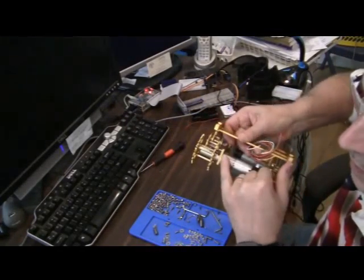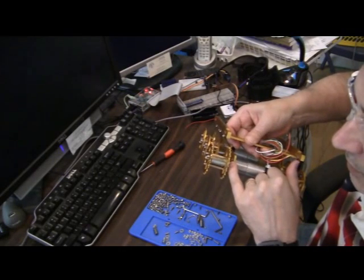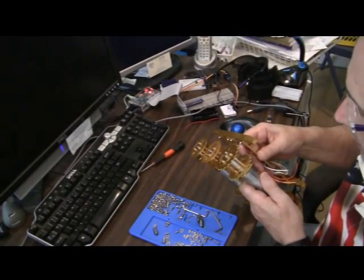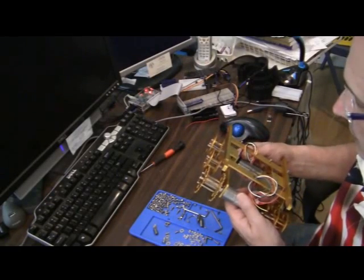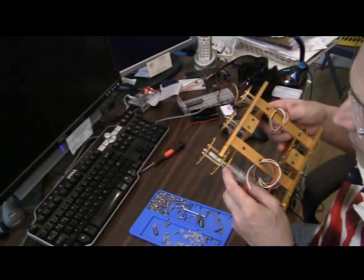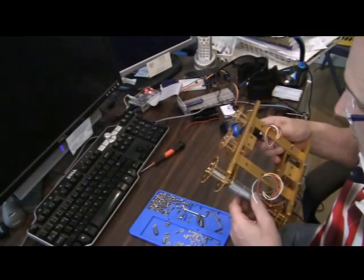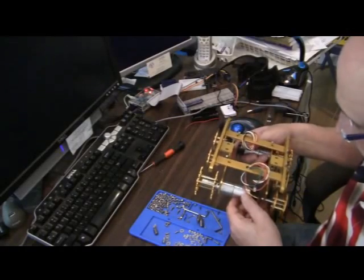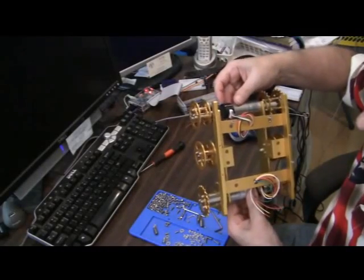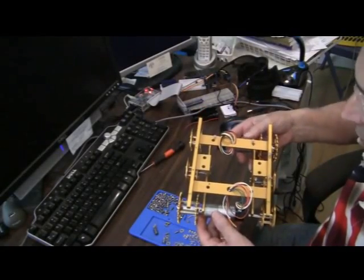That's so the screw heads, and you can see one just above my finger there, lay flush to the bar. And that's important so that the set screws don't hit them. I initially tried putting it on with the standard screw, and the set screw was hitting that. The other thing that you want to note is that the motors go at opposite ends, so the lower bars have to be mounted accordingly.